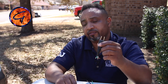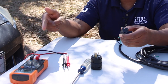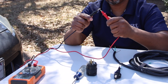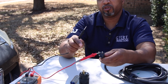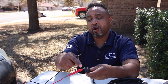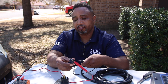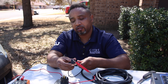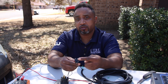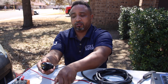Now I've cut this end of the cable off and I need to figure out which of the three wires is hooked up to which prong. I'm going to use the multimeter set to continuity — when I touch the two leads together it makes a tone. Testing the first prong: the green wire gives nothing, but the white wire beeps, so the white wire is connected to that prong. Moving to the other prong and testing: the black wire confirms continuity. So the white wire goes to one prong, the black wire goes to the other prong, and the green wire will be the ground.